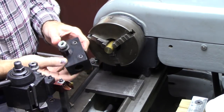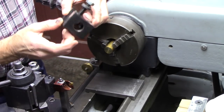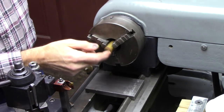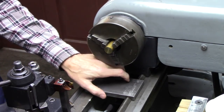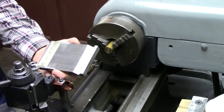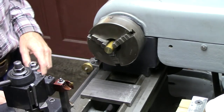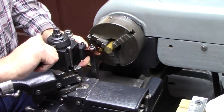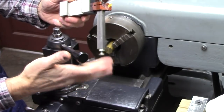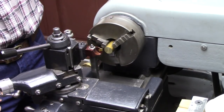Okay, first thing I want to do is cut a brass slug to go into this boring bar holder. This is three-quarter inch and I've got to cut this to length. I've got everything set — I got a carriage stop here, I got a cut-off tool support. I covered it in another video but it works really well for this lathe. This post sits on the support. Drop it on there and go. I can even use auto feed.